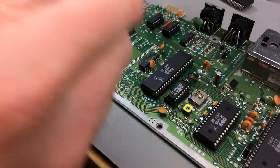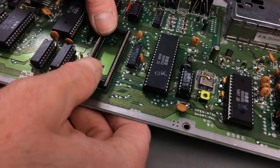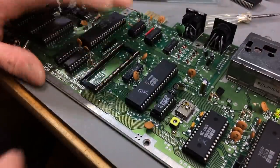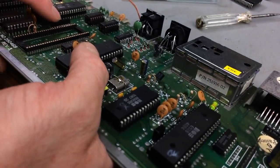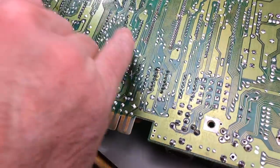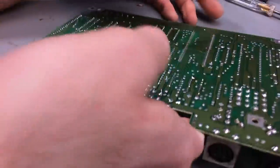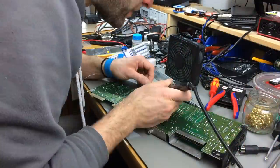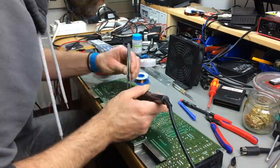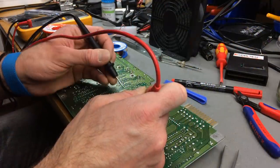So okay, let me put this monster of a socket in. That's pretty neat. Looks great, actually. Yeah, but that doesn't look too bad. Okay, this one can get in there. Yep! And we're in. Nice. Okay, and I want to go from the third pin to this. I marked where I put the botch wire, so I don't get the pins confused. So let's try and solder in the new socket, which should be the easier part. There we go. Our little botch wire. Okay, definitely working.